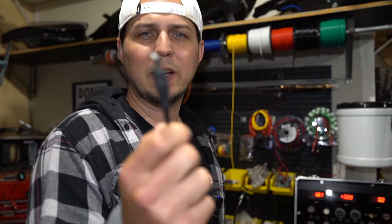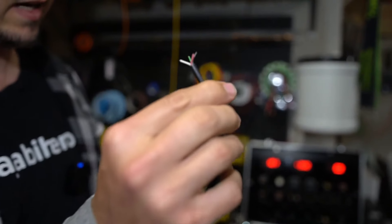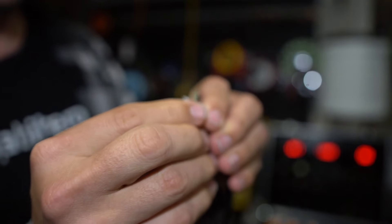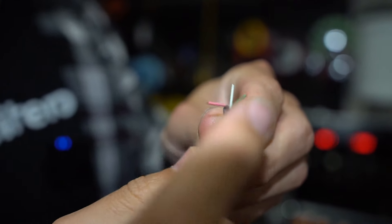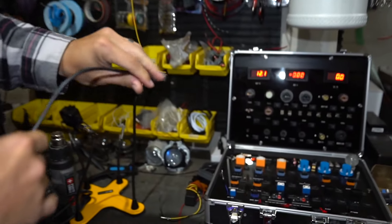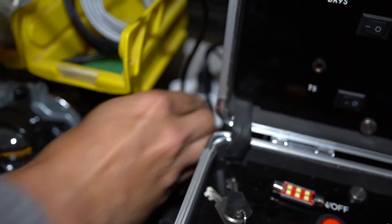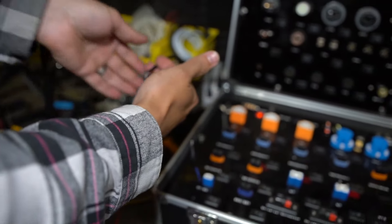So if you look, this is a regular USB cord and it's got four wires inside of it. What I need to do is strip the ends. I'm pretty sure it's the green wire and the black wire, but I could be wrong. So I'm going to strip the ends and test it after I plug it in. I'm just going to plug it into this little outlet that I have right here, and I know that this thing is putting out power. I just need to make sure that I'm getting five volts.